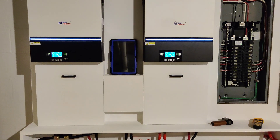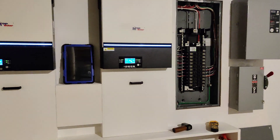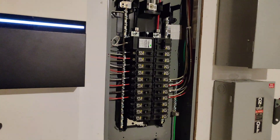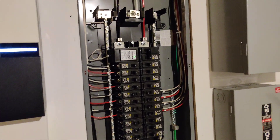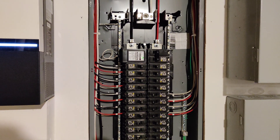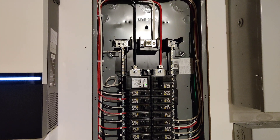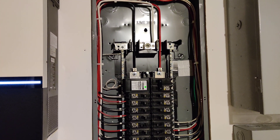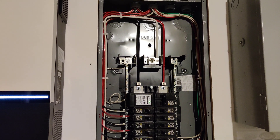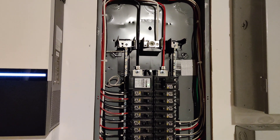Everything's been running great, but I do have an issue. A couple days ago I cranked everything up that I have associated with my sub panel, and I wanted to measure — because this is a split-phase system — especially on the neutral. It's a shared neutral and I want to make sure everything's pretty well balanced, and then see if I can add some more circuits on this panel.